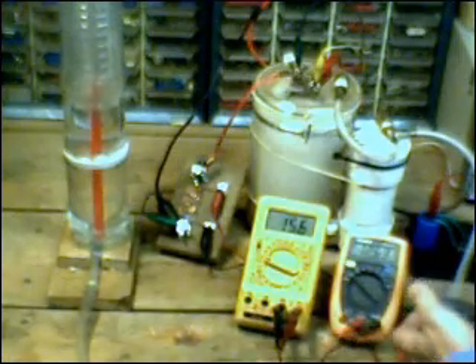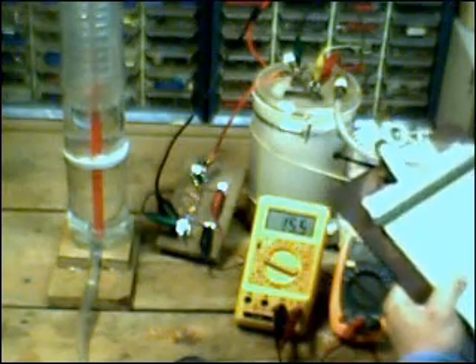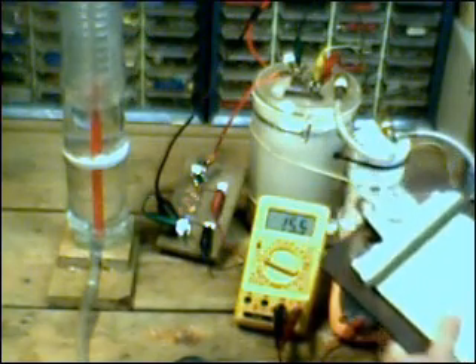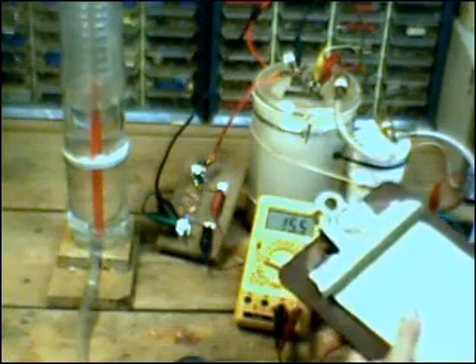The numbers are: we had 260 watts going into the cell, I produced 1.111 liters per minute, and at that rate I had an efficiency of 4.27 milliliters per minute per watt going into the cell.